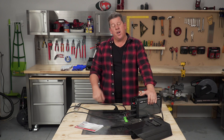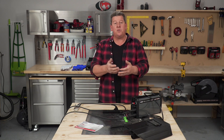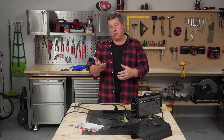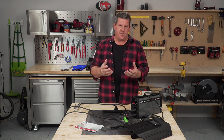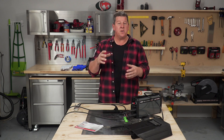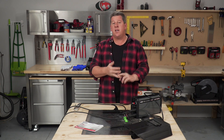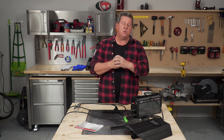When you're using an arc welder you're creating molten steel, which will join those two pieces of metal together. In order to do that you're creating like a fire or an arc, and where there's fire there can be fumes. So it's really important to weld in a well-ventilated area and create some air movement — open the windows, put a fan around — just make sure all those fumes are taken away from you and reduce the chance of breathing them in.